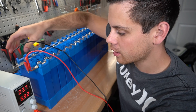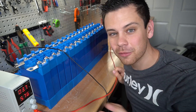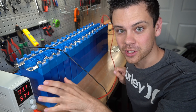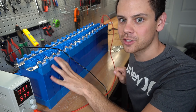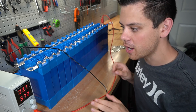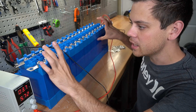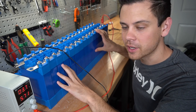So first, connecting over here, we've got 5.92 amps and we have 5.7, so it's off by 0.2 amps. But as this decreases, this will be less and less of a problem. Once it hits 0.1 or 0 when these are actually balanced, the amount of current difference across the whole battery bank is very, very small. Pushing 0.1 amps through a 150 amp bus bar is not going to be an issue. You can actually test this out by putting longer bus bars and using a clamp meter to see how the current is flowing, and I've done that.